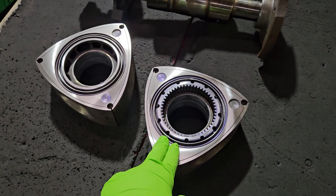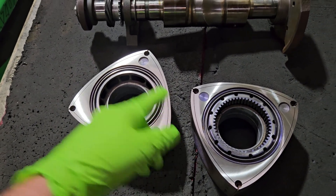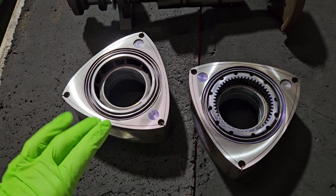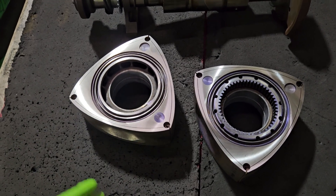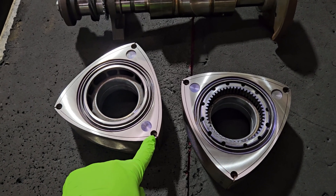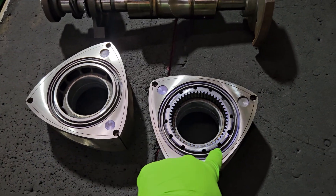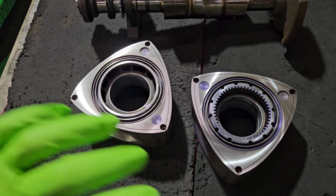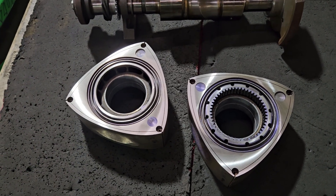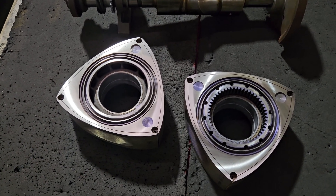This rotor is on a trochoidal spin that's got pressure and exhaust and explosion happening. So if you're familiar with rotaries, you can actually see this wear characteristic or this rotational pattern in tip and side housing wear, bearing wear, gear loading, and overall how the rotor housing and side housings generate wear. There are pressure points and a lot of actual distortional movement or weeble wobble to the rotor.